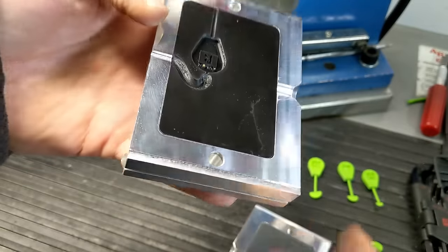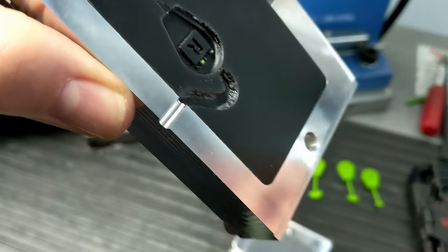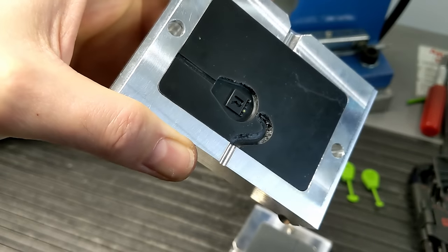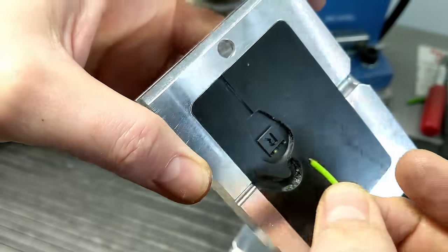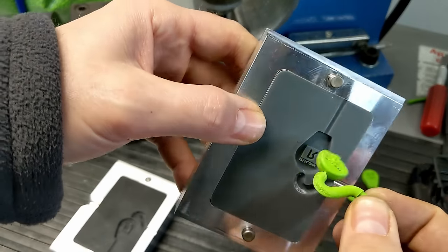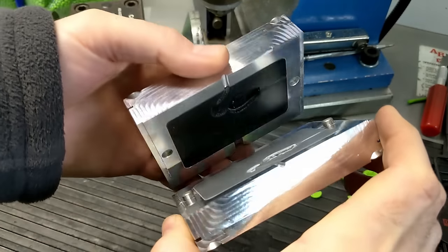Draven noticed something very useful — the low-temp material is just starting to melt and tear apart, and that's where we're getting the sprue deformation. The low-temp is definitely a no-go; you're not going to get even 5 shots before it melts. It comes in hottest at the sprue and flows from there. I'm actually surprised it's holding up as well as it is. We're trying different pressures and temperatures, getting different flow properties, and we'll keep experimenting to see how long until this one totally fails while the high-temp side keeps going.